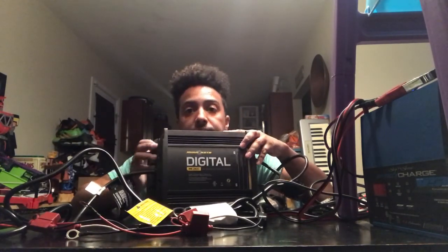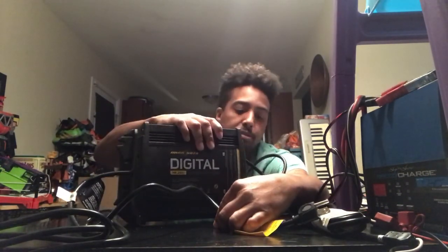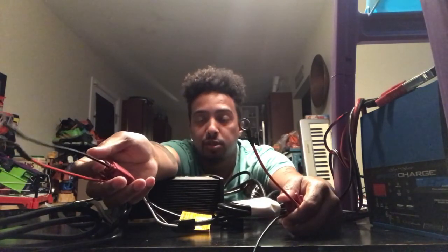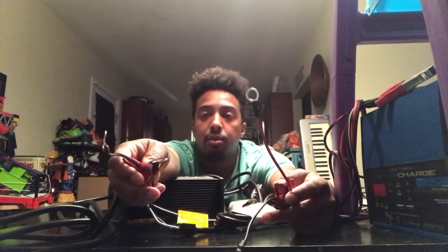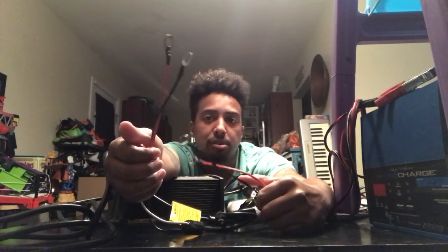Now I've decided to play with the big boys and went straight to the Minn Kota digital onboard charger. Still in the box this morning — I tried it temporarily by plugging up the cables. You're talking a couple of hours tops. This one is a dual 5-amp charger with two ports, so I can charge both my trolling motor batteries simultaneously. I upgraded to a 24-volt system with a 65–70-pound thrust motor, so having two banks charge at once is huge.